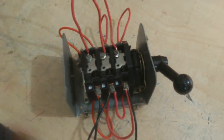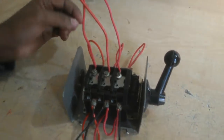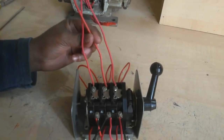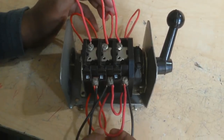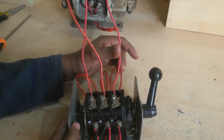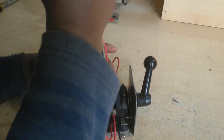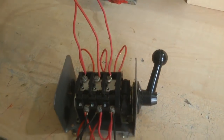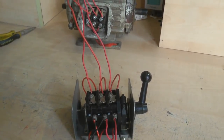When they switch to this position, this wire gets line 1, but this wire gets line 3 — because it is the line 3 wire — and this wire gets line 2. This changes the connection, and that is the purpose: in this position the motor moves clockwise, and in this other position the motor moves anti-clockwise.